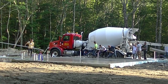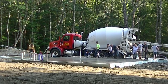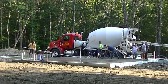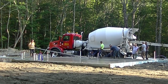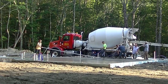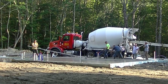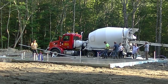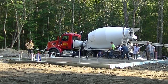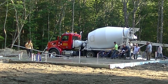You can see Luke right there and Tia — they're pulling the concrete back, pushing a little up where there's a little hole, making sure my boot prints are filled in, and just allowing me to keep my eye on both ends. This house floor, with that vibra screed and this size crew, took us about probably 30 minutes to pour, get all straight edged and all screeded out. It's pretty fast.